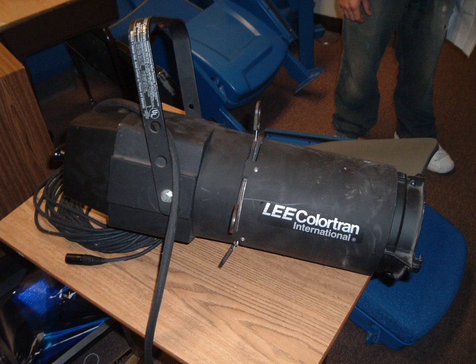Since the release of the Source 4, other lighting manufacturers have revised their products to compete in the market share alongside the ETC. The Selecon Pacific, an L-shaped ERS, has an irregular shape due to an integrated dichroic cold mirror, which effectively splits the visible wavelengths of the light beam from the infrared, allowing the heat to be drawn off by a heat sink and away from the instrument.